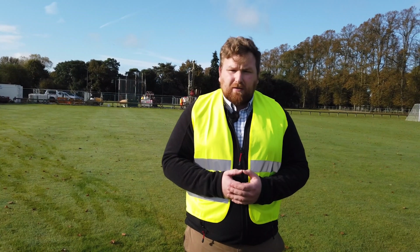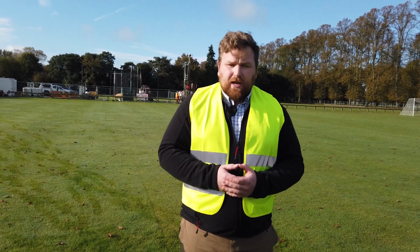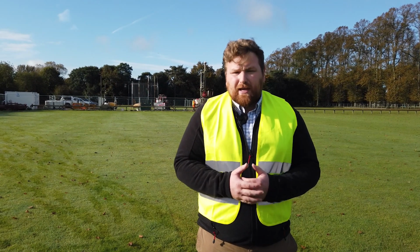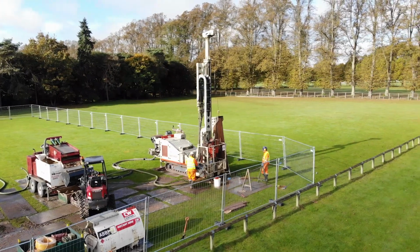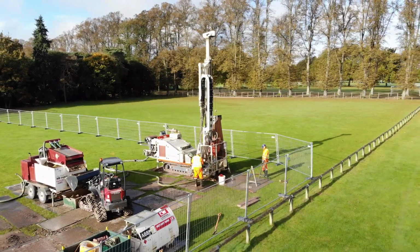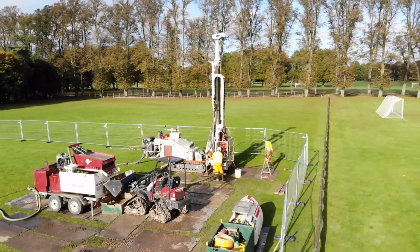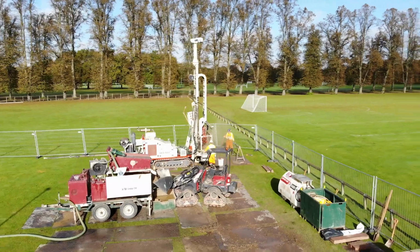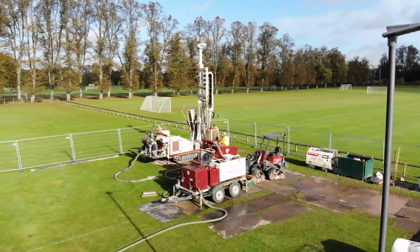And the same system could be used in a grid for several homes, for instance? Yes, district heating schemes again are quite common. It's something very common on the continent, but not really taken advantage of here in the UK. We've done small district heating schemes on country estates, and there are other companies out there that have been doing low-cost housing, for example, to reduce running costs against direct electric heating. So it certainly is feasible and viable as an alternative.